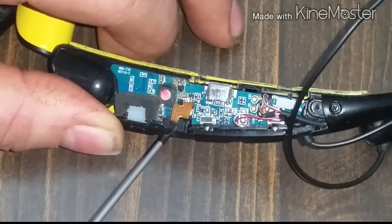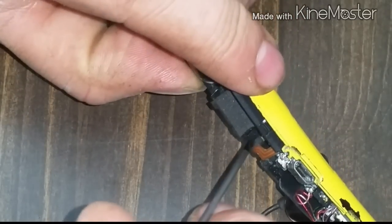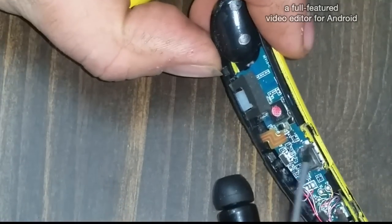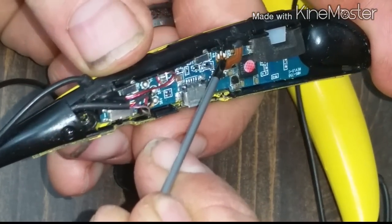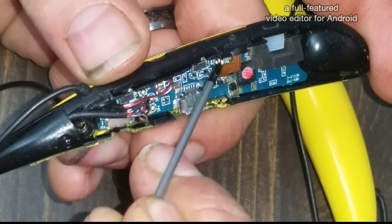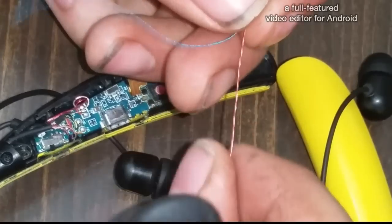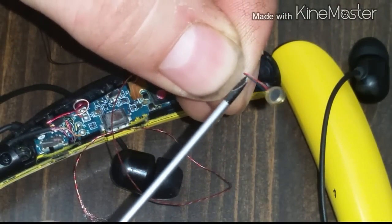The HBS 750 has a ribbon instead of just wires. If you pry it out you'll be able to get to it, and you'll see on the back it's the same thing — the microphone is encased inside a rubber piece. You can cut the microphone out of the rubber piece. On the inside are the positive and negative solder points. The colored wire is the positive; the wire with gold, or red and gold, is the negative. You do the same procedure as replacing the earbuds — cut the wires and add enough solder to the ends.